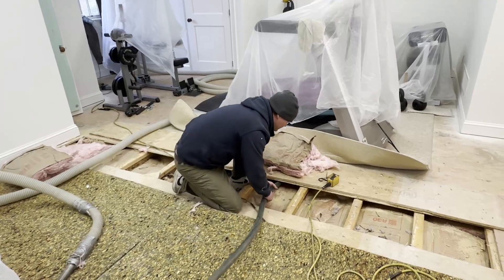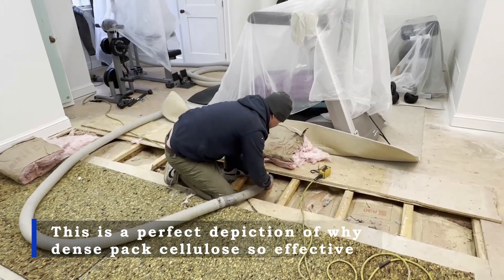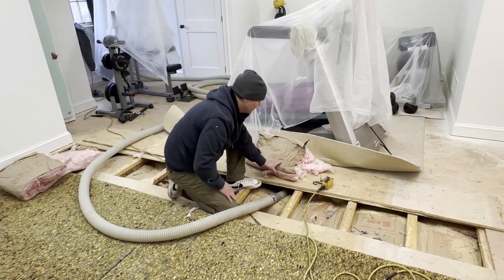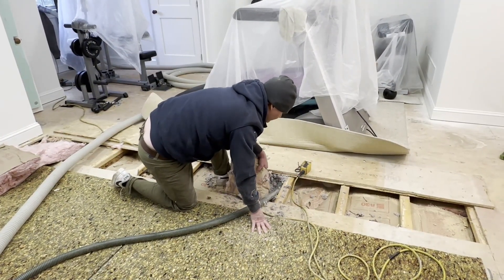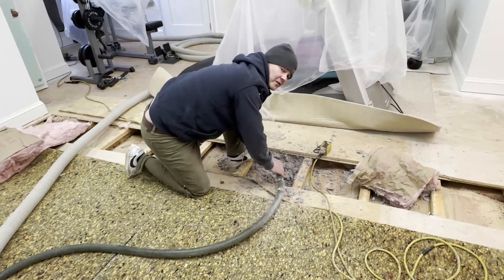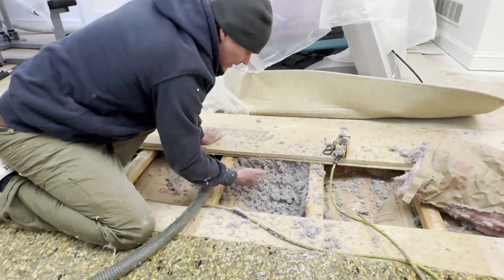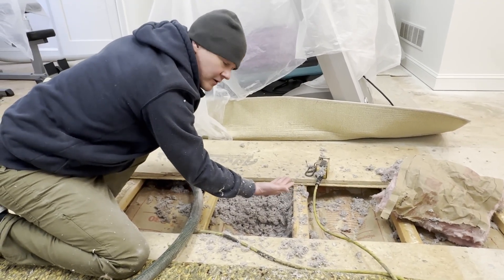I'm now demonstrating how effective it is to use a fill tube to insulate a closed cavity like a floor joist. This is the same process as the previous garage ceiling, just done from above. Once the fill tube hits the exterior wall rim joist, we switch the machine on and allow the dense pack insulation process to happen. Once the bay has been completely filled, we turn the machine off and allow a few seconds for the air pressure in the hose to die down — should have waited a little bit longer for that one, but fortunately cellulose cleans up easily. Now we can see how firmly the cellulose has been packed against the underside of the floor, compressing the fiberglass beneath it. The gap that had been causing the problem has now been completely filled and eliminated.